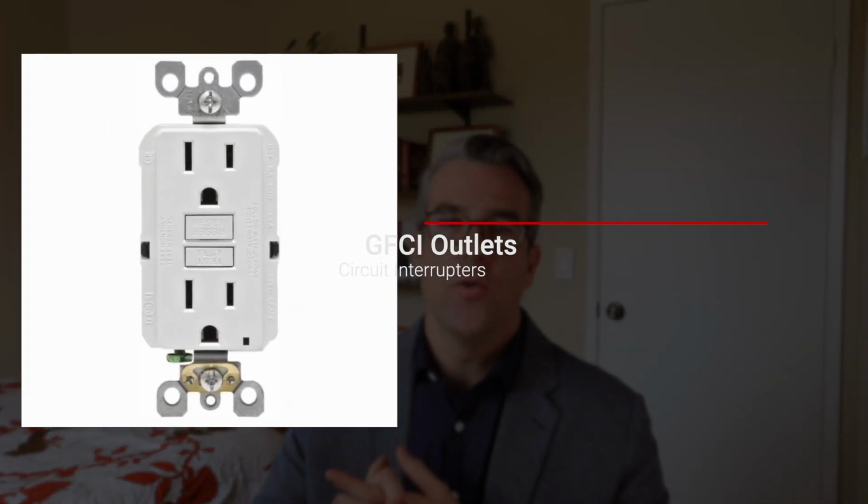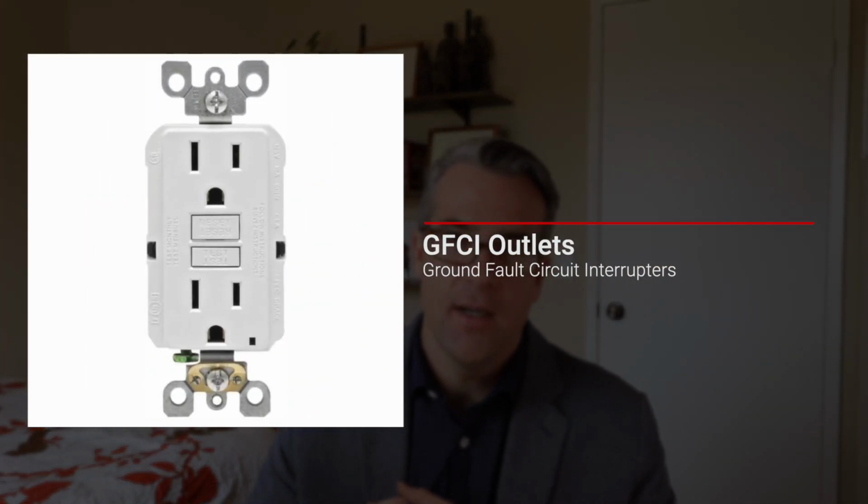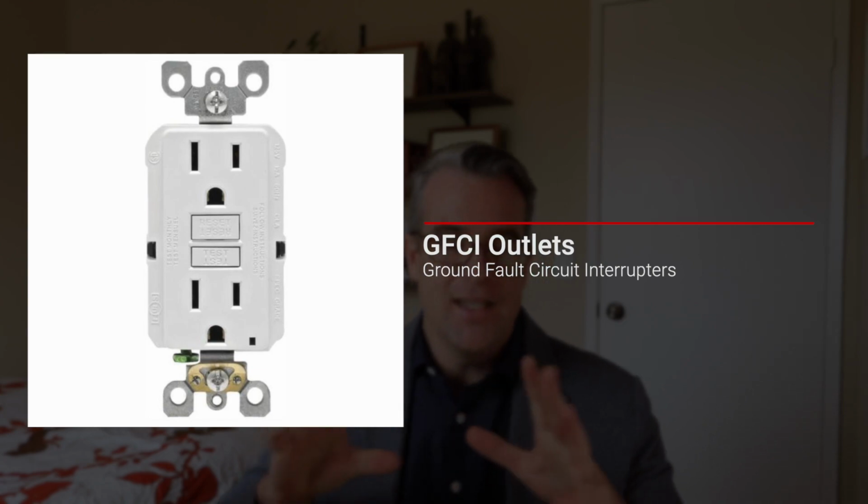Next thing I see come up all the time is GFCI outlets. That's a ground fault circuit interrupter outlet. It's usually one that has little buttons in the middle that you press and it clicks. A lot of them are self-testing to make sure they're working properly. Use that receptacle tester to test it. You typically need these anywhere there's a water source, usually within 6 feet of a water source, like 6 feet from a sink.